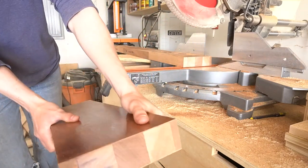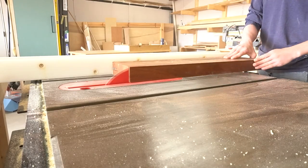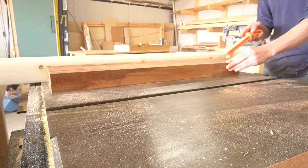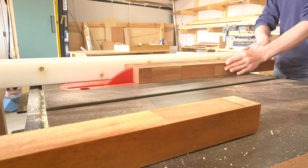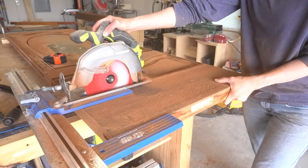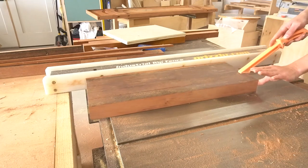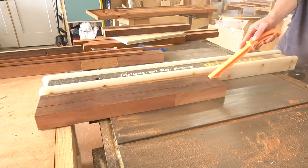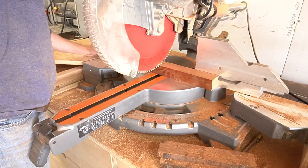This was disappointing, but still workable. So I cut this piece into shorter lengths on the miter saw and ran them through the table saw along the glue seams to get my solid pieces for the cutting board. By the time I cut out all the usable pieces from one door side, it was not nearly as much wood as I thought it would be. So I cut off the other door side and the bottom to use as well. I really didn't want seams showing between my boards, so I trimmed these strips down into just solid pieces, and most of them were fairly short pieces.